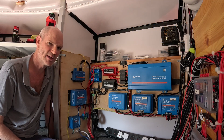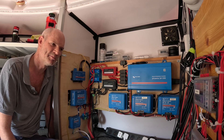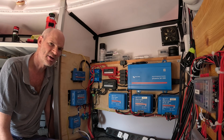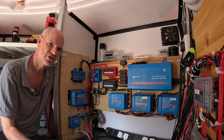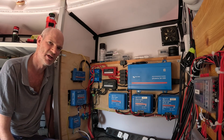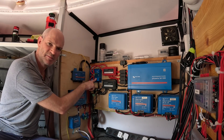However, that is not the right way to do it. The fault developed because back at the start of the summer it was really hot in the observatory, and I went down to the local electrical shop and picked up one of those small portable AC air conditioning units. I thought I'd give that a try in the dome to see how much power it draws on the solar system. When I first plugged it in and switched it on, you could hear that massive inrush into the system, and that pulled the system down on short circuit protection and under voltage. Ever since then it appears the damage has been done to the smart battery protect.